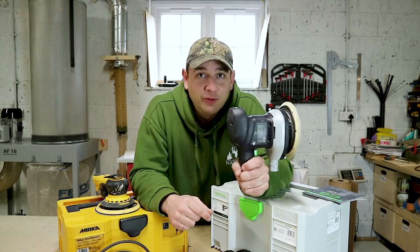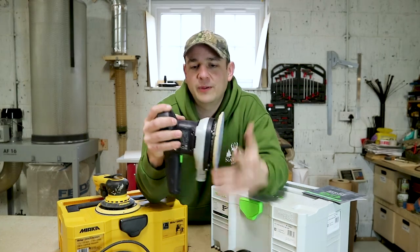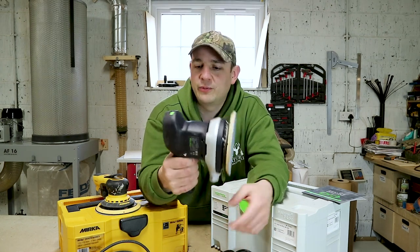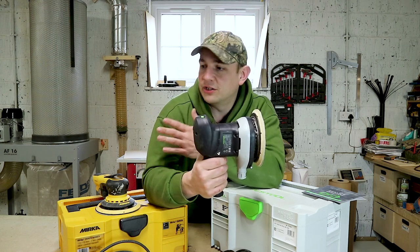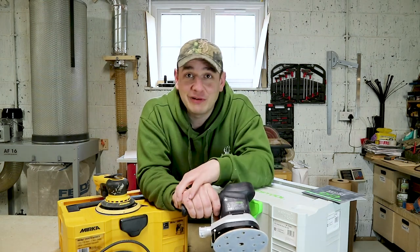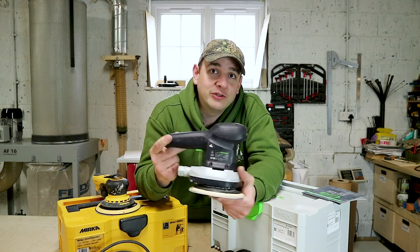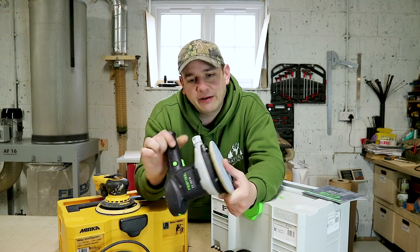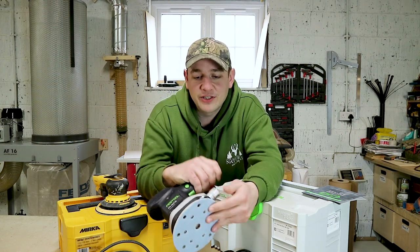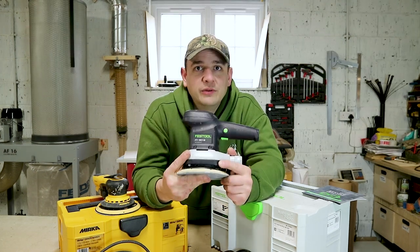However, if I was to be sanding a wall with two kilos — your hand's way off centre from the centre of gravity. Up high it's not too bad, but you're going to be down here for the vast majority of the time, which means it's going to keep pulling your wrist down, putting additional strain on your wrist, forearms, and shoulders. After a few days, that's really going to hurt. Maybe if you've got issues with your wrists, hands, or forearms, this probably isn't the tool for you. But if you're going to do a huge amount of stock removal, this is perfect. It also comes with its own little allen key, and dust extraction is awesome.